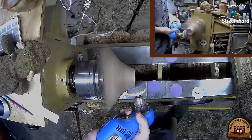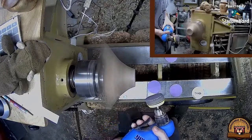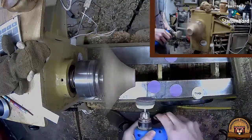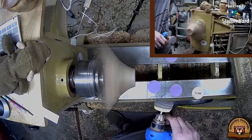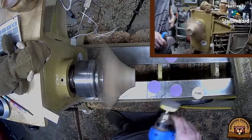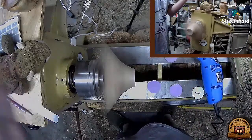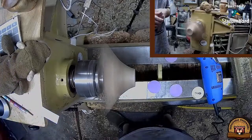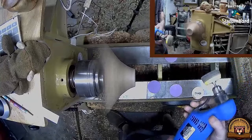Douglas Mungham has a question. Hodge, I have a Delta Homecraft 1953 10-inch bandsaw that I got on eBay in the USA one bit at a time, and it does not have a slot. How would I make your circle jig? I guess you could, if you made runners that fit the metal table on the left and the right side, you could kind of get it in there. You can also clamp it down to the table. That's the only thing I can think of.